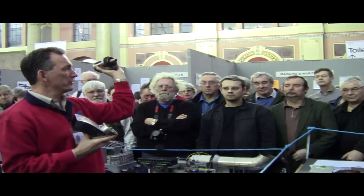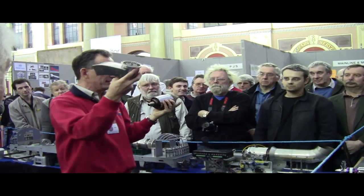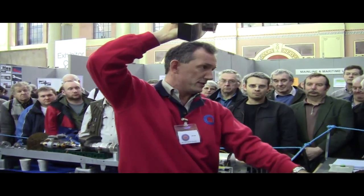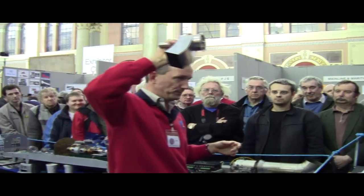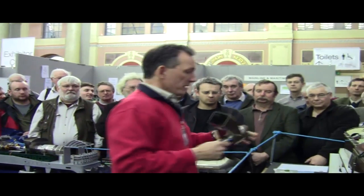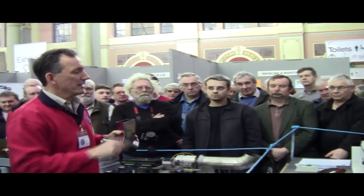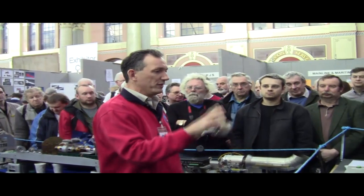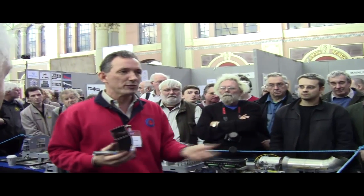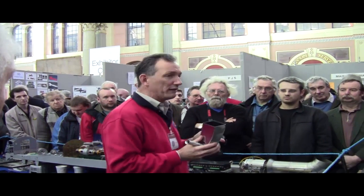Although the engine can go up to 160,000 RPM, because we've gone through that large diffusing duct, the free power turbine never goes above 50,000 RPM — we've reduced the velocity and increased the pressure to get maximum torque. A 100-to-1 reduction ratio down to the wheels means that even at this ratio, this locomotive on a nice straight even track could probably reach approximately 40 miles an hour.